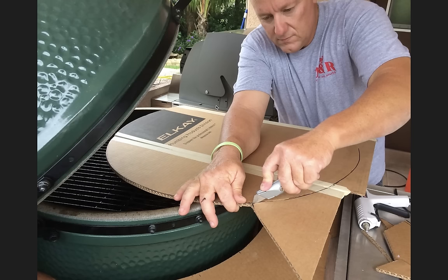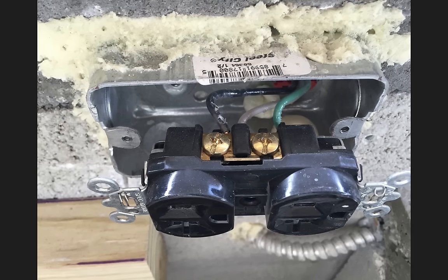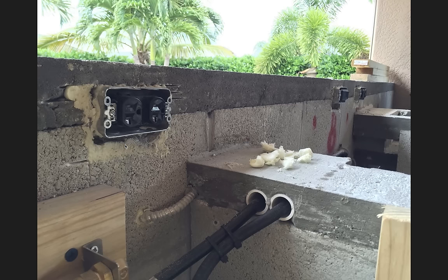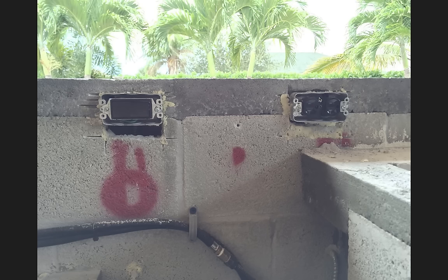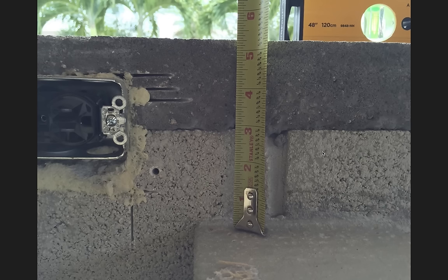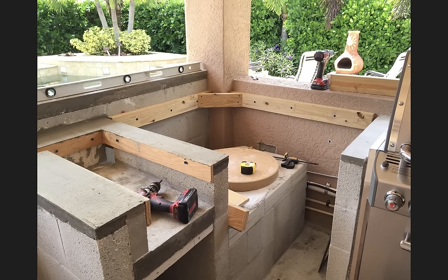I have some videos of them cutting the granite. Here's one of the outlets — you can see here's where I had to raise it. The outlet originally was down here and I had to bring it all the way up to here. Here's a better view of just how much space there is — that was a lot of work, but it got it centered. Here is where I made a mistake on the leveling. You can see it's about an eighth of an inch here and almost a half inch here. Basically what I did was reframe everything, measure again and again, and then pour a skim coat of concrete all the way around.